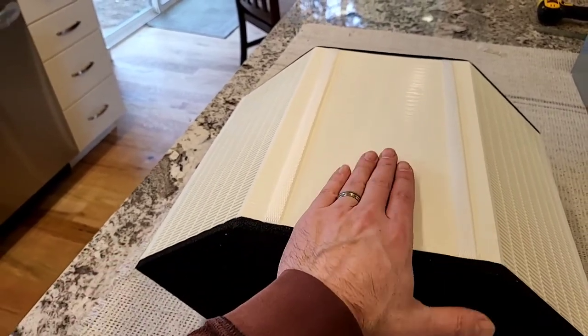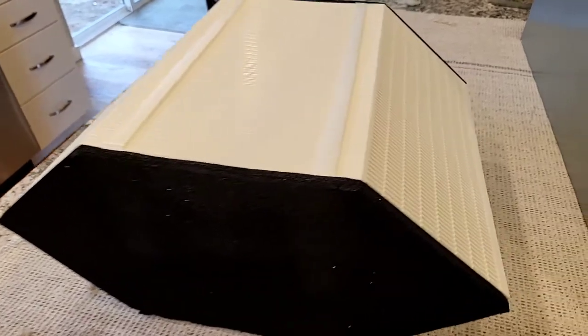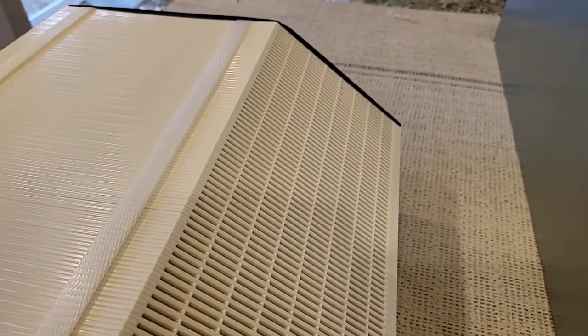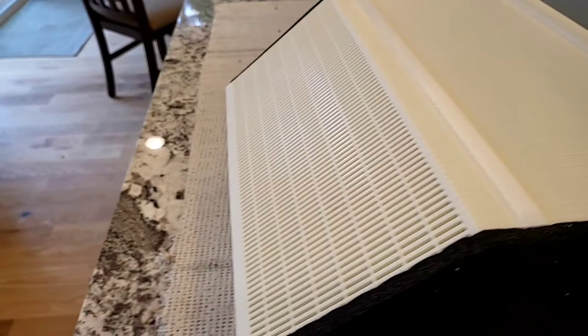When we look on the sides, we see that same solid situation. From the backside it's basically a mirror image — but flipped over, this is what's coming from the house going outside, and this is what's coming from outside going through. That's basically how it works: two airstreams that get very close together and allow for the transfer of water molecules as well as heat.